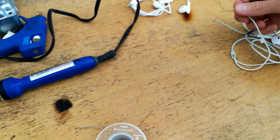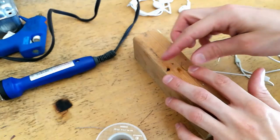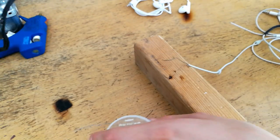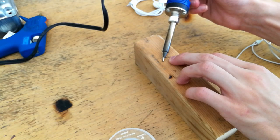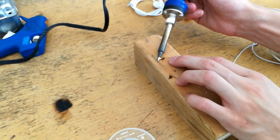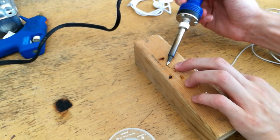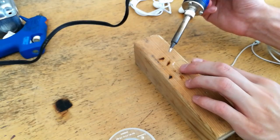So here we go. You can either use the knife and board, or what I found is quite effective is you can just force the soldering iron onto the conductor until the enamel finally melts. First clean the tip of your iron, set the conductor in such a location that you can work on it easily, and pre-wet the tip of your iron slightly. Now hold the wire down and basically just let the soldering iron burn away all the enamel and let it char the wood underneath a little bit - it won't hurt that at all - and pull it away gradually to leave a nice well-tinned section of wire. You may need to refresh your solder if the flux has dried up. Do the same for the other side and gradually you should come away with a nicely polished wire.